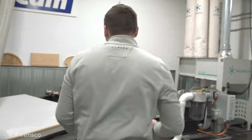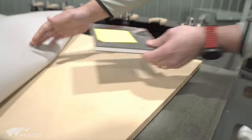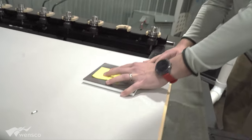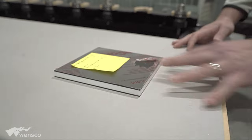With no vacuum even on, you can see the difference: if you're just using a regular spoil board, the part will want to move quite a bit. It doesn't take much effort at all. But on our mat, you can see it takes a lot more force to move it — it won't slide as much.